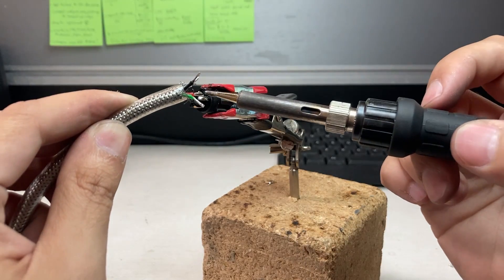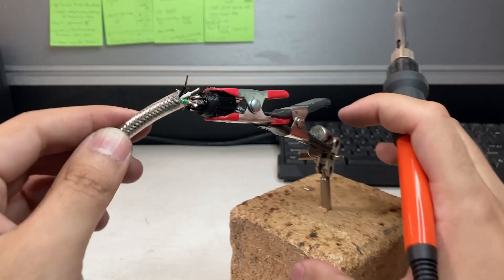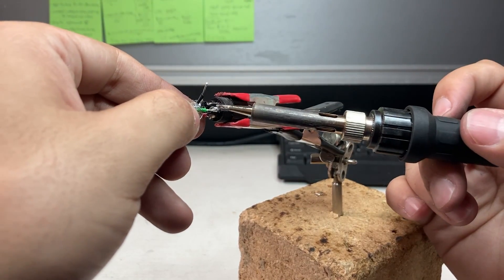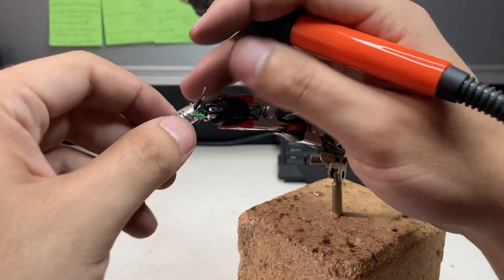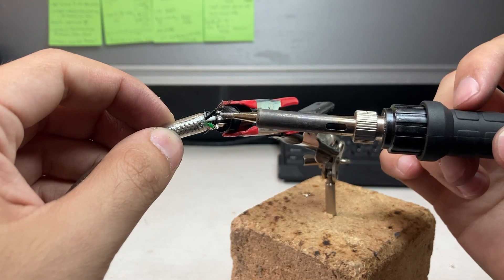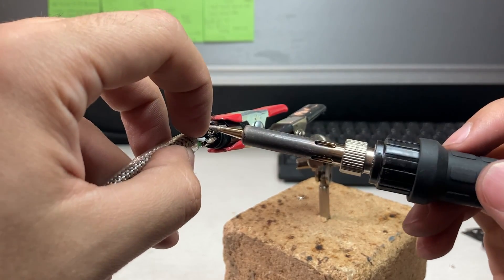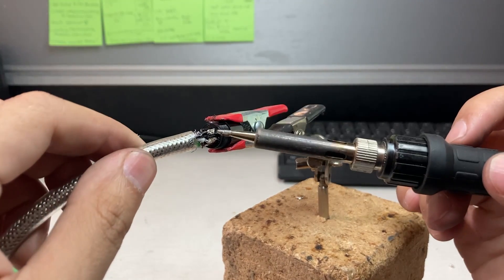This is why we tin both sides — because you're able to see it better. And I'm going to pull them together. Okay, so that's one end soldered on. I turn a little more. So now second pin, heat up. Okay, that one's fine. Next one — I'm going to heat this one up a little. And the last one. You might need to have some solder on the tip of your iron to help with heating it up. Got that one on.